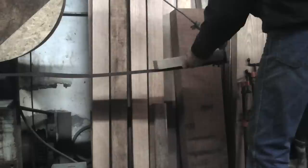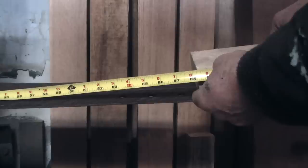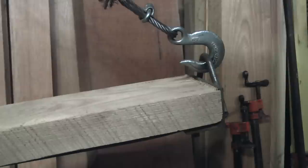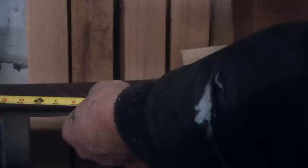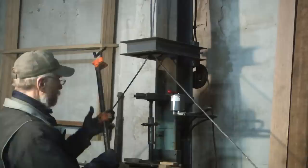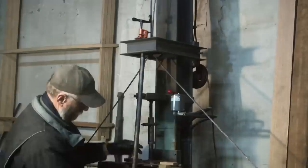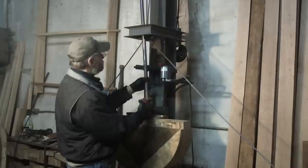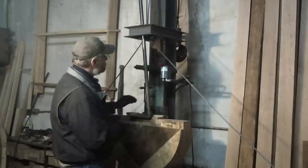There are always a few odd factors, and this one shows up as about a quarter inch I need to accommodate. I have my little eighth-inch straps — I'll put one on each end to take up the difference. I'm also going to give some support to the top pulley frame. When the fellows start to get toward the top, the pressure really gets exaggerated, and bending this heavy wood I have had this top frame give way before. So now I reinforce it. Since I have the top pulley frame on a slide so it's adjustable, it's that slide that has given way in the past.